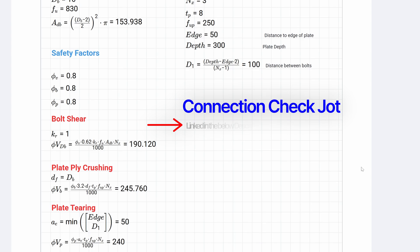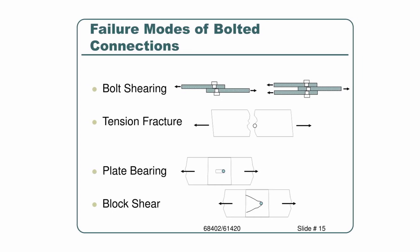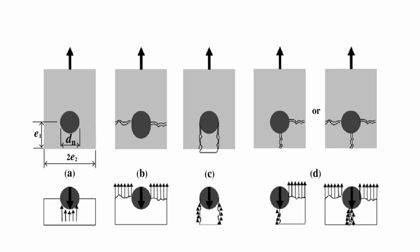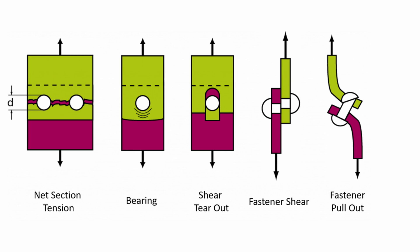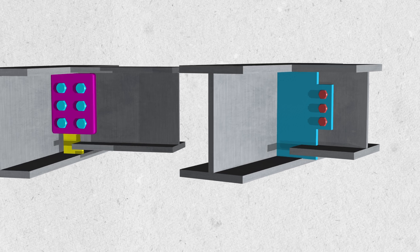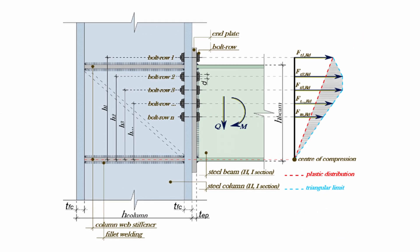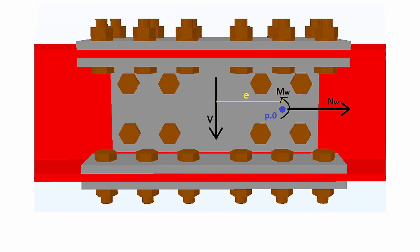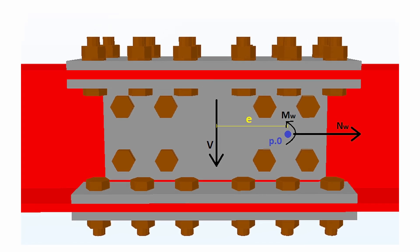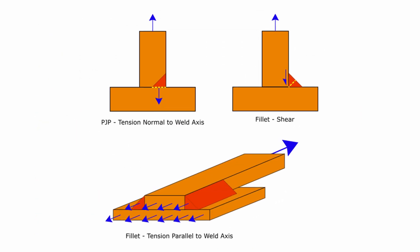There are a few other things to consider when doing a bolted connection. While welding plates together involves a pure shear transfer, with a bolted connection you also have the bolt hole, bearing on the bolt, shearing on the bolt, and tearing in the plate — a number of things to consider for connection strength beyond just the bolt itself. Where a welded connection is more about the plates and sizes. One important point: if you connect with a fin plate, it won't transfer any moment as it allows for a little rotation. Where if you want to transfer moment, you need either an end plate or flanges top and bottom. It's also careful detailing around welded connections, especially in tension, to make sure they're oriented in a planar direction rather than parallel to the direction of force.